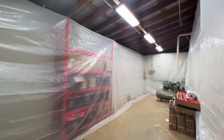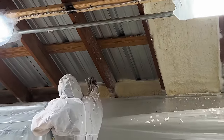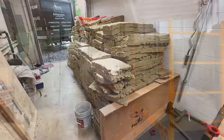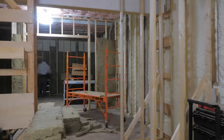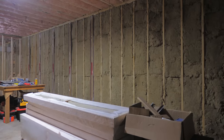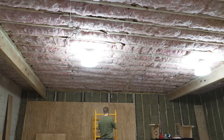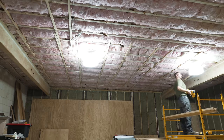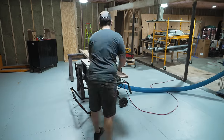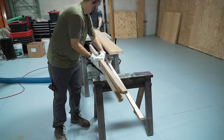Once the walls in the shop were sprayed, the crew moved to the addition, again masking everything off, then spraying a thicker layer of about three inches of closed-cell spray foam — about R-21 — since that would be the only insulation in this ceiling. With the spray foam crew's work wrapped up, the mineral wool was installed on top of the closed-cell foam in the shop walls. Once the mineral wool was installed, there was one more thing to do: coming back and adding furring strips across the batt insulation in the ceiling. Since I'm going with a drop ceiling instead of drywall, there'd be nothing to keep the insulation in place over the years, and without furring strips it would tend to fall out of the ceiling. Nate got the entire shop done and we could officially call the insulation work complete.